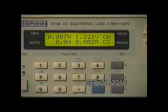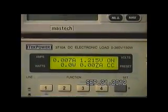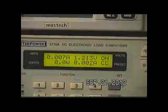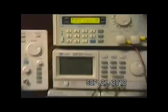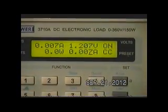But anyway, we can see here that we're pulling that 7 mils out of there. The voltage is going down, and I'm not going to sit here on the camera all the time that we discharge this thing, but we're 2 minutes into it, and you can more or less get an idea of what's going on here. And you can see that this particular metering circuit drops at 2 thousandths at a time in reading. It doesn't go an individual thousandths. But anyway, I think I proved the point. That was not a ghost voltage. I am not attempting to prove the fact that that battery is in beautiful condition, because it definitely is not. It was not, and I knew it. And I just wanted to see what we could actually do here. And I'm very, very surprised at it, although you can see we're starting to drop more rapidly now.